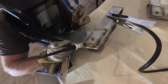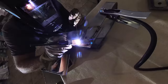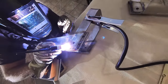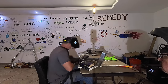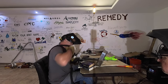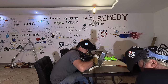Putting a few books underneath, positioning yourself before I start to weld, even doing a few little test runs before I actually hit the pedal and fire it all up, I've learnt taking my time to set up and really get the positioning right before I pull the trigger really gives me a better weld. I find positioning the torch line over my shoulders creates less pull or drag as I'm working my way along a weld. So it's all those many little things that really make a difference. Like I say, it's a really big learning process of combining all these little tips and tricks.